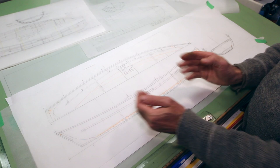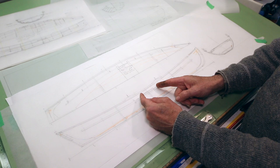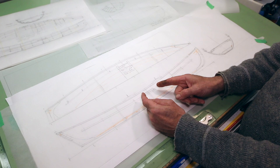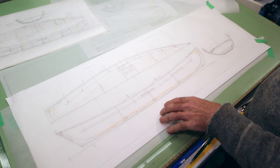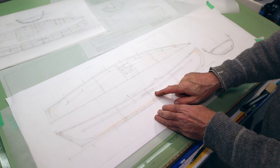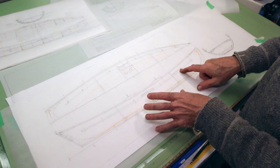That's actually, Joe wants one that's like really deep. So we're making this like 16 inches wide, which is crazy wide compared to most boats, which usually have thwarts of about like 9 inches wide a lot of the time, or even less. But Joe likes a big comfy seat, and he likes to put a padded cushion on there. So he requested this big wide seat. So we're going to put that in, and then he wants just a single station for rowing forward, but doesn't want a thwart there all the time.